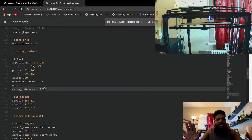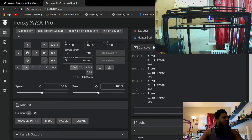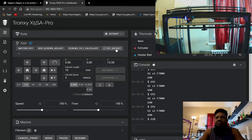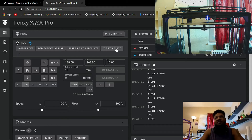That's all you need to put in the config — it's really simple. Now I'm gonna give you a full-on demonstration of how it works. I purposely tilted my bed really bad — maybe at a five or ten degree angle. You can see it's really out of alignment, it's not even square at all. I want you to see the magic of how it works so you have an idea of what it does. I've seen this before and a lot of people don't demonstrate it properly. So I threw my bed completely out of alignment so you can understand what it's doing. I'm glad the console is right here so you can kind of see what's going on. Let me auto-home first, and then I'm gonna do a Z-Tilt.